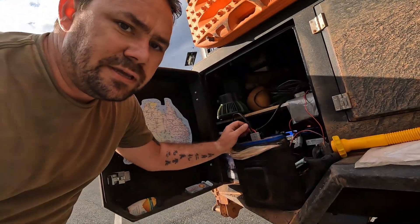I have actually killed the battery pack three times. The first two times I was able to recover it through my AC/DC charger in the camper trailer. I've got alligator clips to Anderson plug — I just took the terminals off and hooked that up to the AC/DC directly, then directly charged it through the Anderson as you can see here, and that brought it back.